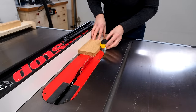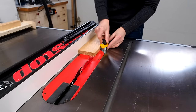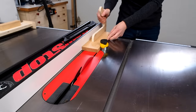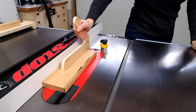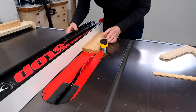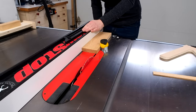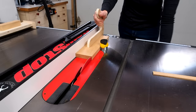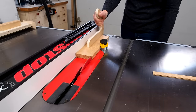Another option is to use a physical reference like this mag switch to the outside of the blade so you can batch out multiple strips of the exact same thickness. Once in position just turn the knob to activate the magnet and it's locked in place. I like the safety of this method but the drawback is that you constantly have to adjust your fence on every single cut, which can be a bit finicky to get just right.